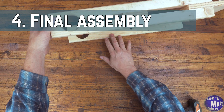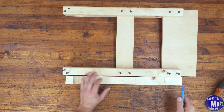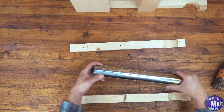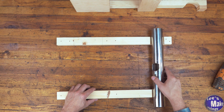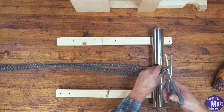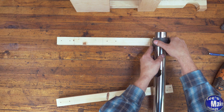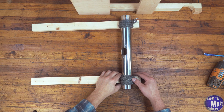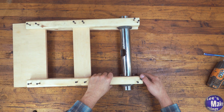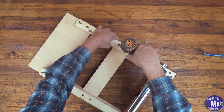Now we need to take the screws out of just the back piece so I can add the pipe in the middle. I want to make sure I put these on the right side, so I'll mark the letter X. I'll take my pipe and fit it right inside that groove we made. The gasket is six feet long, so I'll cut it off at three feet and wrap it around the pipe a few times, overlapping as I go. With both pieces put on I can line everything up again, finding the X, and squeeze it down just tight enough that it won't unravel or pull out.